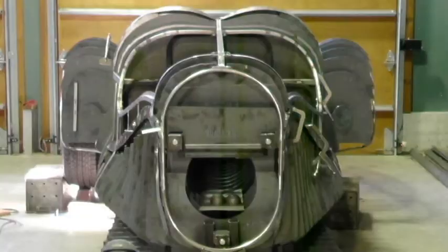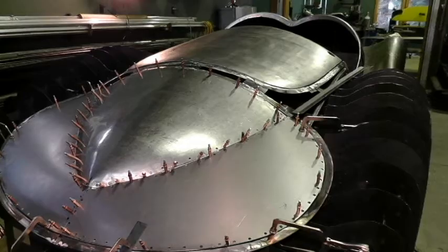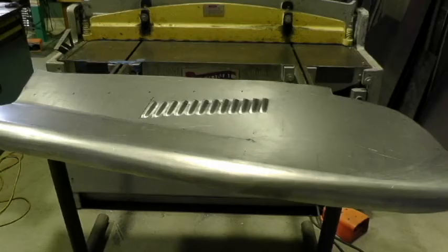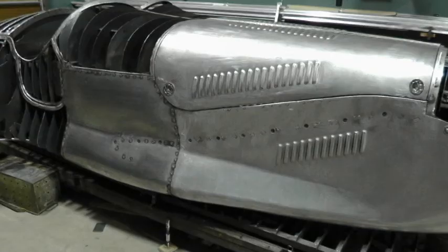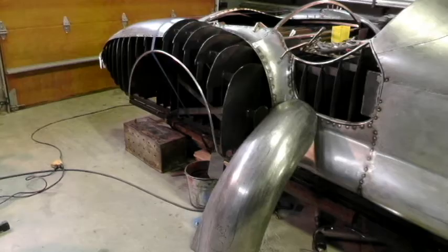Lots of fitting, English wheel, and little stretchers. Here are some panels that have quite a bit of shape to them. It all starts out with a paper pattern over the buck — a layout. You create the panel and then fit it to the buck. Those three pictures give you an idea of how that works. Lots of clamps involved to fit everything together.